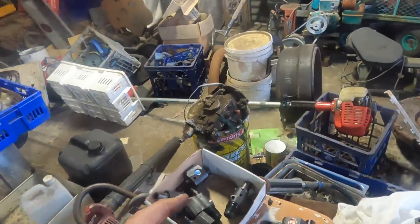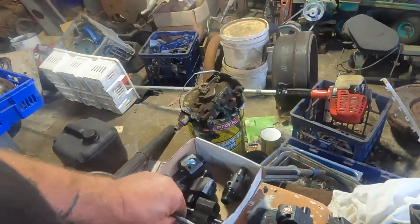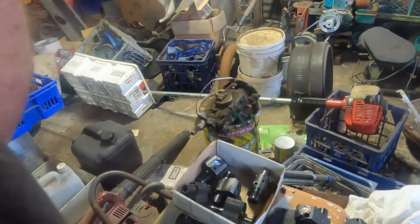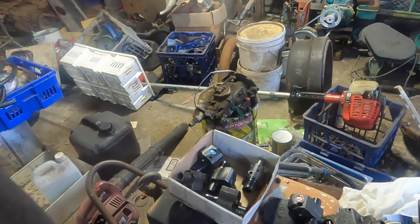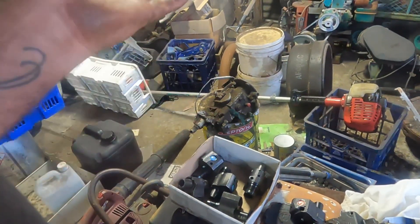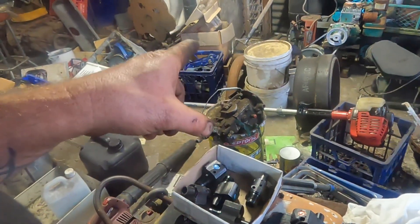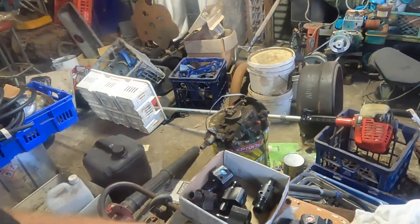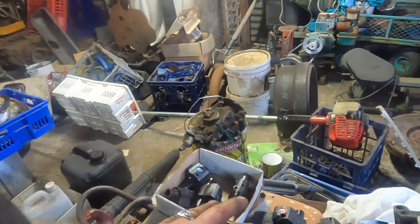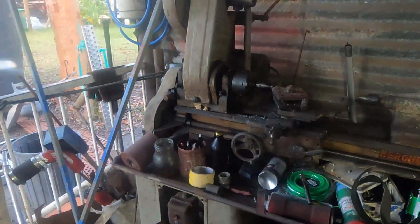They've been running these two-valves and still are in the locomotives at the moment — they're a bit slobbery, they do a lot of idling. So this will be a bit better than the old dribbly H37s, and hopefully they'll have a bit more power out of them. We'll see in another video later — I've just been up there fixing overheating engines, wrong thermostats, all sorts of fun stuff. Anyway, I'll get these machined — I'll update with the rest.